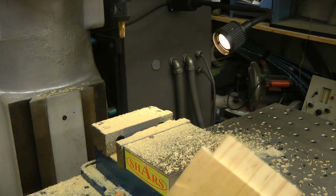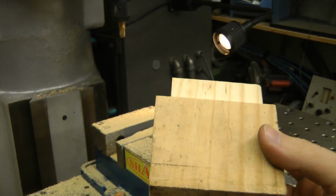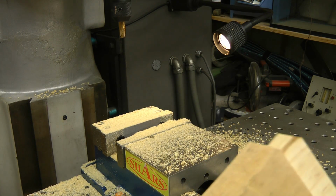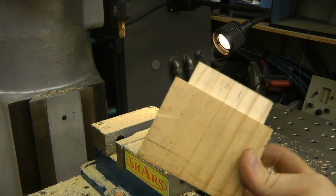We just need to solve that axis problem. It seems to be sporadic. Sometimes it will change by about 2 thou or so, just like a step change. So I'm wondering if there's some problem with one of the encoders or something to do with the wiring.